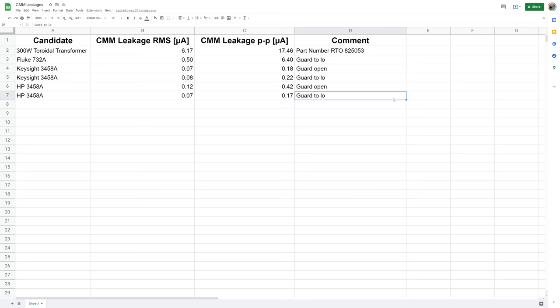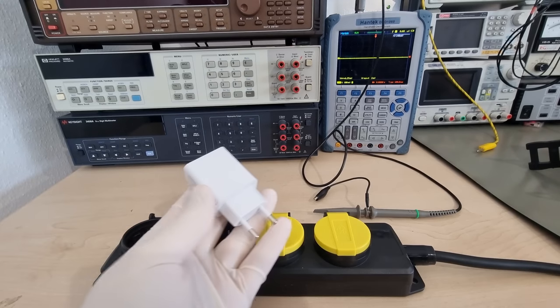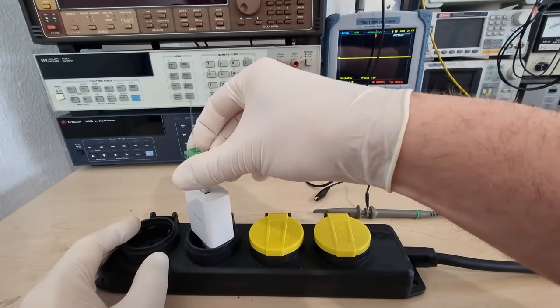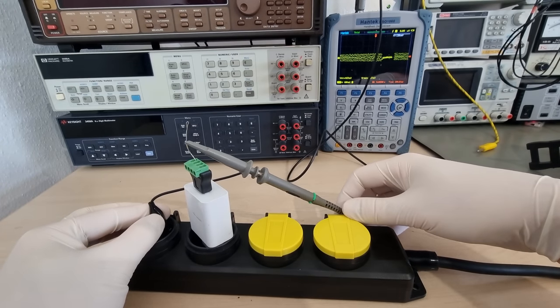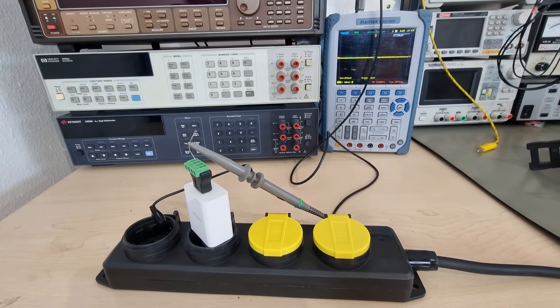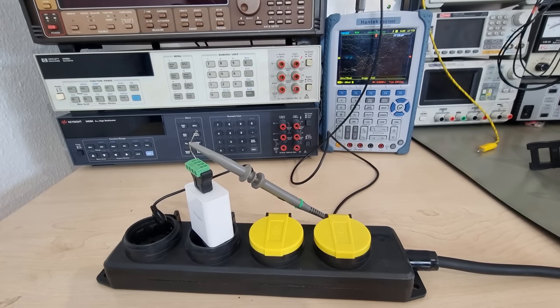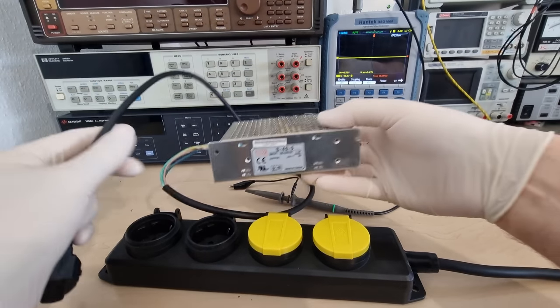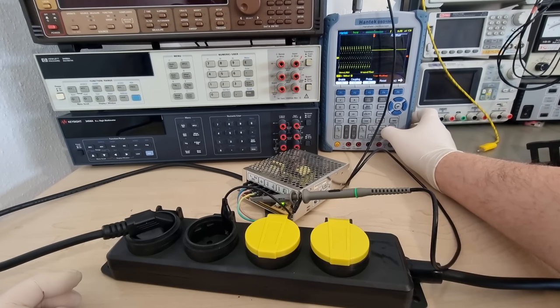I think we have to slow down lest we reveal all the best performers right at the start. Let's see if an especially gnarly cheap switcher can out-leak the toroidal transformer. This whole thing weighs about as much as the USB screw terminal thingy. Maybe I should plug it in — that might help. Almost 10 µA from this thing — that's pretty bad. How about a brand-name switcher? The well-meaning MeanWell is pretty good for a switcher: 750 nA RMS. Switching converters are quite complicated, but the main contributor to these unwanted currents is the very same one that plagues us in linear transformers: interwinding capacitance, which is of course much worse with the ultra-low-cost, ultra-miniature transformer that the five-volt power brick uses.